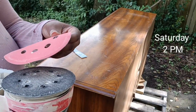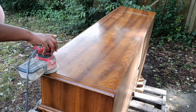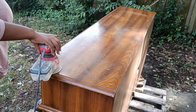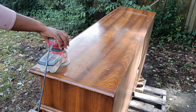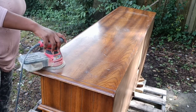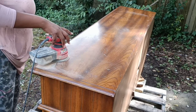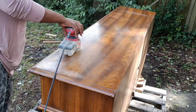I'm going to go ahead and start sanding with a 220 grit sandpaper and my orbital sander. Typically sanding is the step that takes me the longest, but surprisingly in this flip that was not the case — so stay tuned to see what else I encountered. The reason I'm using a 220 grit sandpaper is because I find that creates less work for me in the end. I just like to do this part slow and steady even though this is solid wood, and I find that doing it slow and steady with the higher number creates less work for me.